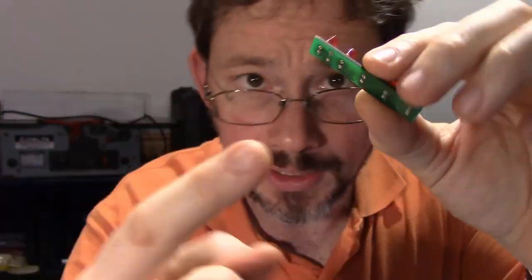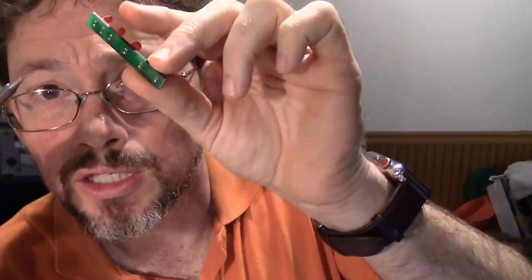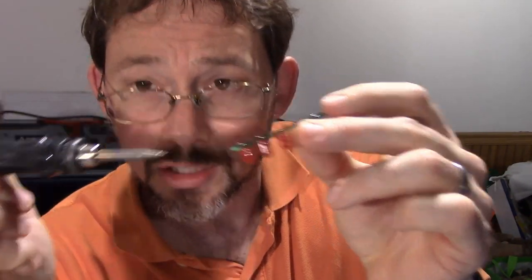On the bottom side, the two pins were going straight through like this, and then I went through with the soldering iron. Got my little soldering iron here, and I'd flip them up, and then I'd put some lead solder on, because this is the point at which I admit to you, I gotta be honest, I really do not like lead-free solder, and I'm a bad person for saying that, but leaded solder is just so much easier to work with. And these things are all going to be enclosed inside of a product, and in fact they're enclosed in one area, and then they're enclosed yet again. You'd have to really work at it to get in here, if you had someone who really wanted to lick the backside of this.